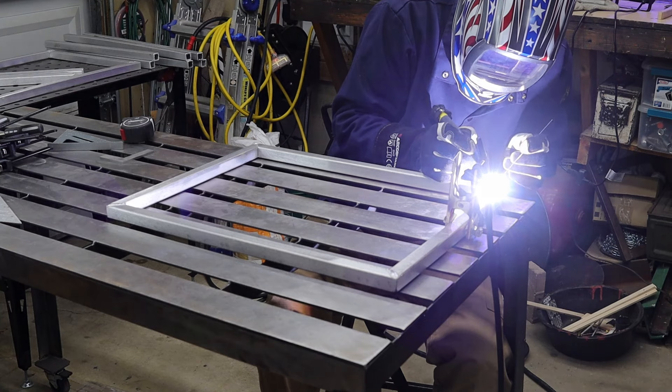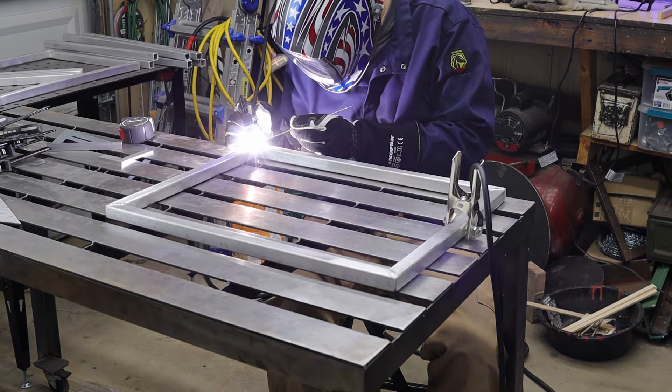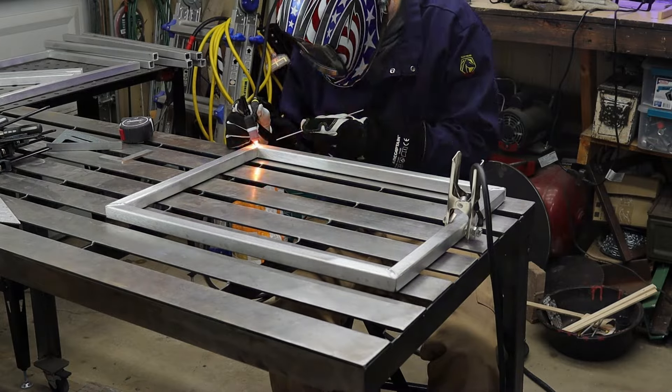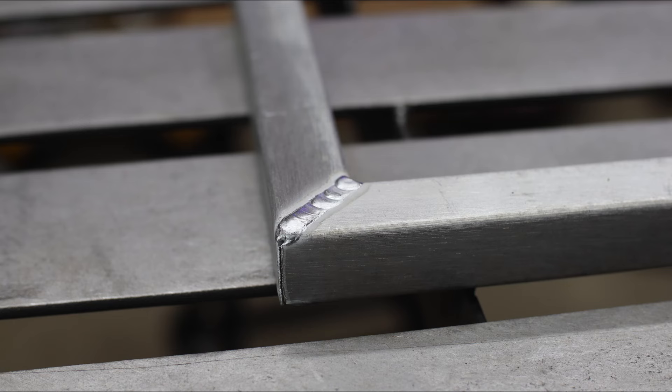You'll notice I'm going from the outside in. Don't judge all the welds by position alone — it really has to do with how the weld is set up and my positioning relative to which way I'm actually welding that joint.